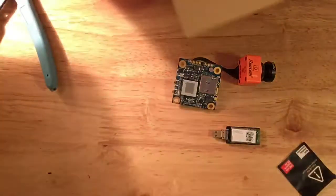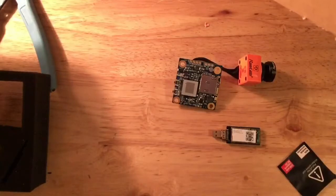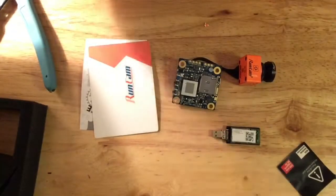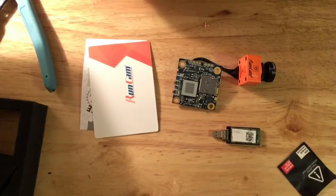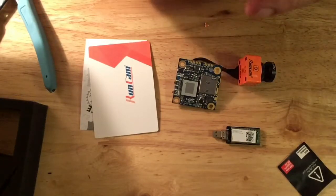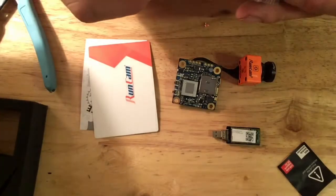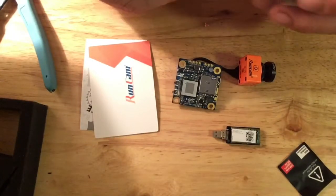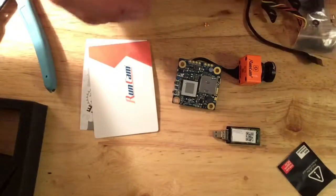There's a Wi-Fi dongle. I have it connected with my Taranis so it's got 3 switches to control the camera. It's pretty easy in Betaflight now — all you do is pick which UART you're connected to, then go to the peripheral and pull it down to RunCam. Once you have the RunCam set up, you can set it for power button, Wi-Fi button, and a select button so you can go through the menu on screen.